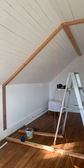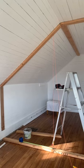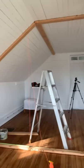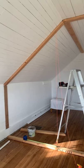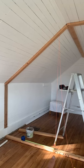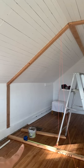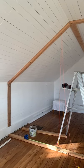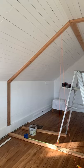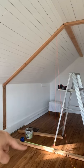I'm just playing with the plumb bob to decide where I want to put the closet door. I'm actually going to be using a door we found in the barn that's made out of beadboard — it's very similar to the existing doors, so it'll be a simple design and I can cut it down to any size I want. I think I'm going to do a 26-inch opening and make a 24-inch wide doorway. It'll be really narrow, but this is a small space, and I can also cut the door at an angle, so that's how I'm going to frame it out.